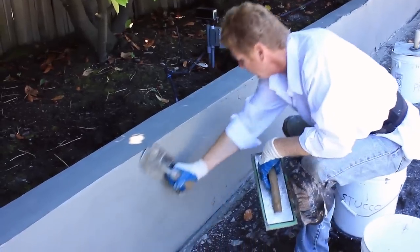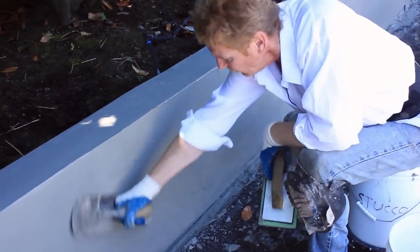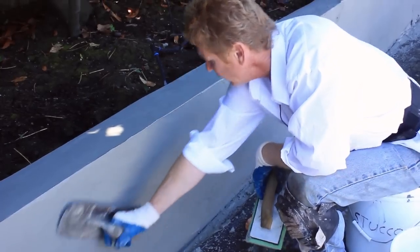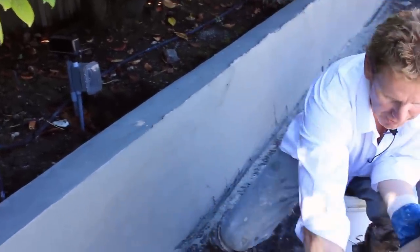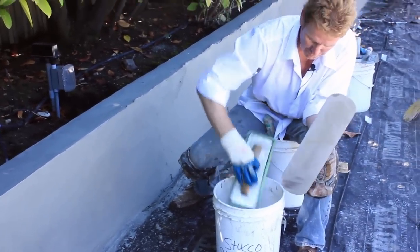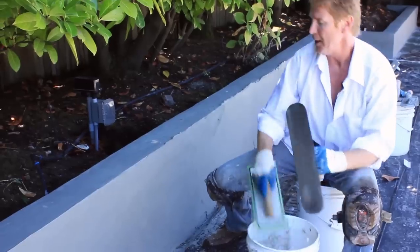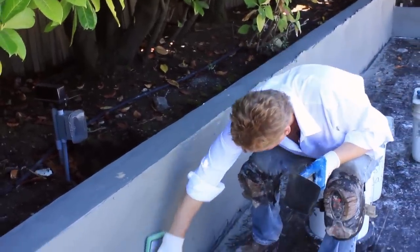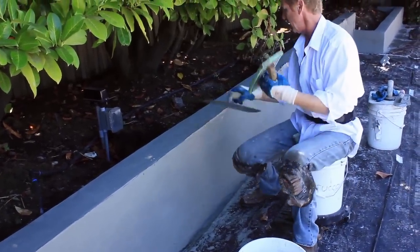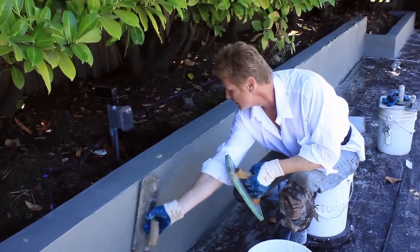If you're going to try to do this, use a square trowel — they start around 12 by 5 inches. Use whatever size you're comfortable with; I use bigger trowels but I'm used to this. I'm going to leave that lip there and keep going across the whole wall rather than fix it now and lose the rest of the wall. A lot of elbow grease and a lot of pressure, guys — the more pressure you put, the tighter you can get it. Wet it down, put some water on it; it's a very hot day and hot walls. Bring it back to life and start the same process over: steel it down.